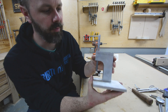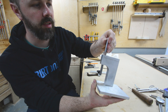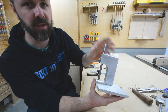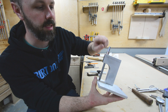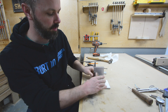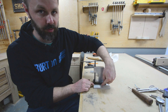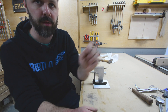All right, this is what we've built so far. This is basically like an overhung arm with some bushings in it, and that's what's going to let the tap holder move up and down and make sure everything stays nice and square. Before I go ahead and build the rest of this tap holder, I want to build some positioners so that I can put each one of my stops in the exact same location. I need an adjustable positioner right here as well as right here, so that's what I'll go ahead and build now.